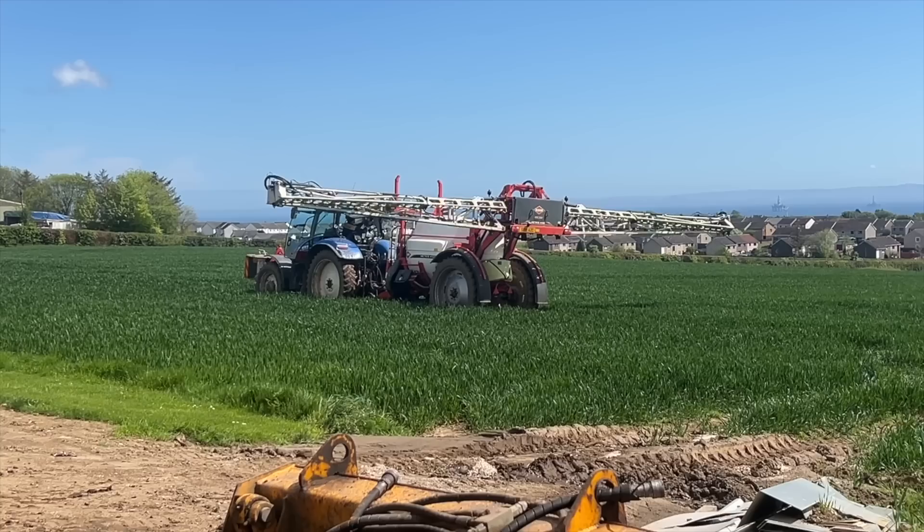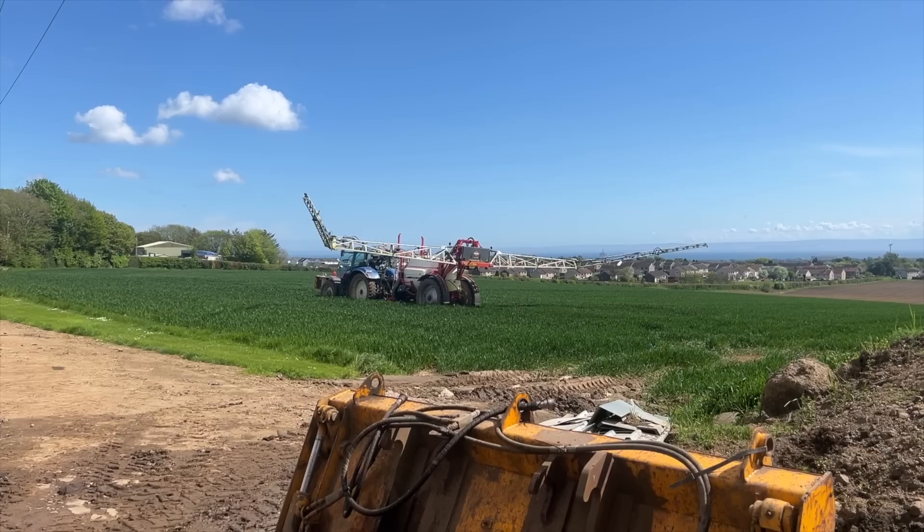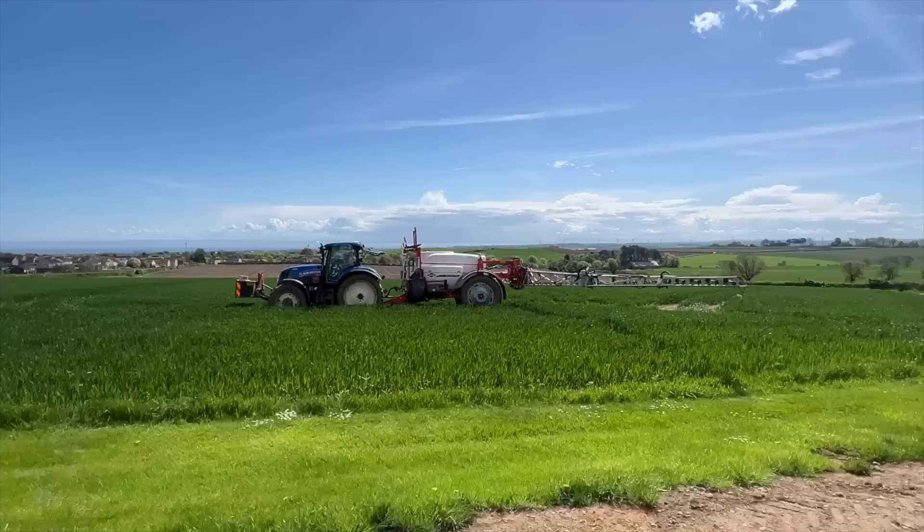The sprayer is very not dissimilar to the one we've got at the moment in terms of functionality — steering axle. The width was a 28 metre and we're at 24 at the moment; we'd probably spec a 27 or a 30, which ties in well with a three metre drill. That was a 4200 litre fibreglass tank, loads of other bits and bobs. Spoke about quite a lot of other stuff with the sprayer, so we'll probably just get a quote for a 27 and a 30 with section control, levelling boom, and compare prices with others. Don't really know what we're doing yet — they had the opportunity to go up and see this one so I thought I might as well tick another one off the list.